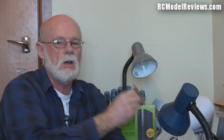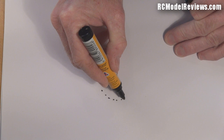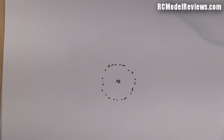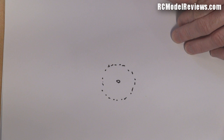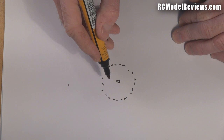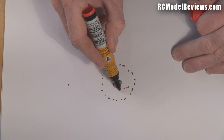I'm going to show you on paper what I've been talking about, and explain why I built a four-channel diversity controller rather than just a two-channel one. Here's our omnidirectional antenna in the middle with its circular radiation pattern — equidistant all the way around — so we can fly anywhere within the 1.5km circle with the backpack. But if we want to reach the 3km mark, we use a helical antenna, which I'll draw in a different color.